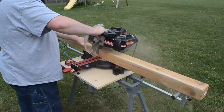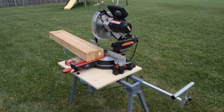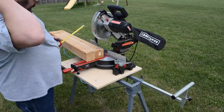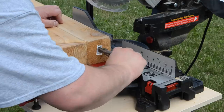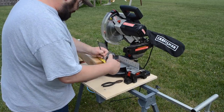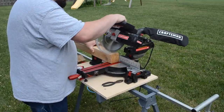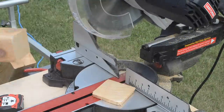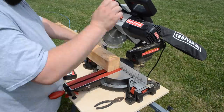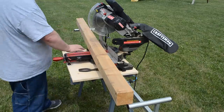Cutting them in half gives us a nice clean edge and makes sure everything is square. I forgot to put the dust bag on my miter saw — make sure to do that. Also make sure to remove any staples, because metal staples and blades really don't play well together. I was cutting these to final length, getting rid of that gnarly factory edge on the bottom, making sure it was nice and square, sneaking up on my measurement to ensure I had four identical-length legs. Pretty much the same procedure on the remaining chunk of 4x4 to make two additional legs.